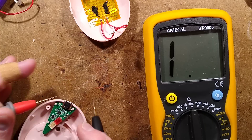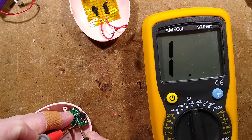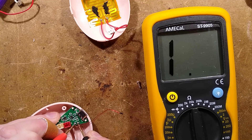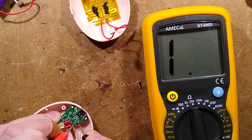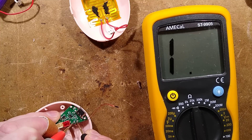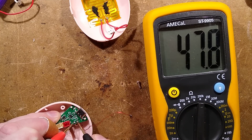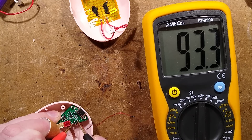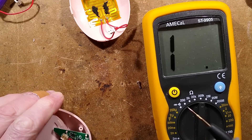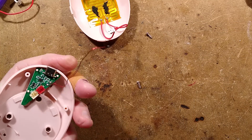I'm seeing the little charge chip, and also what looks like a little 5-pin microcontroller. It might be a 100k thermistor — it is a 100k thermistor. When I say 100k, it's reading 93k. The 100k is 100k at typical room temperature, as is a 10k.